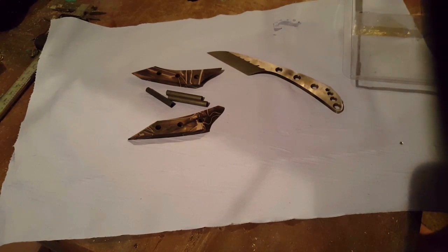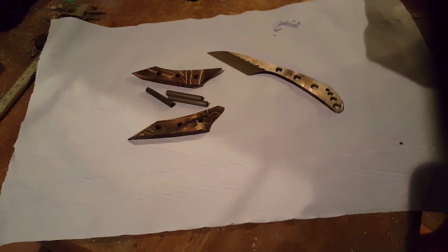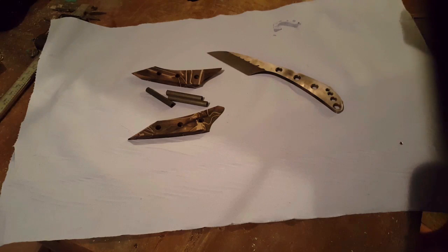And then my plan is I'm basically going to glue every side of every surface, stick it all together, and then I'm going to bind it nice and tight with a large elastic band. Effectively, as this design is so small, it's going to be difficult to get a spring clamp or a G clamp or anything on there in between the pins because they're quite tight together.